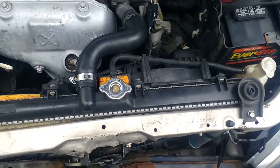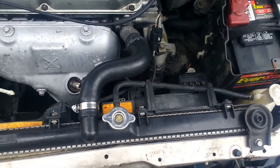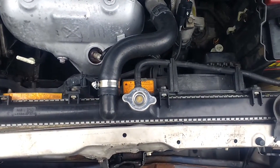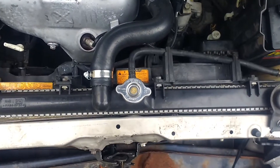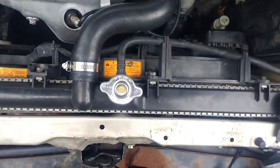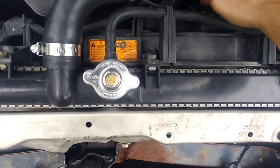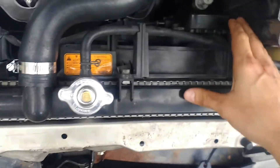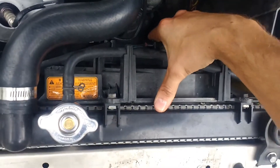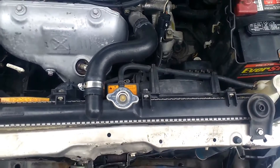I'm going to go to the junkyard and get a new fan controller, because I think something in there is shorted out or something. It's not really a problem to have the fan running all the time, but I'd rather fix it before the thing goes bad. Now it's on constantly — just one fan doing a slow speed, and if I press on it, it speeds up. I'm going to go to the junkyard and see if we can get one cheap.